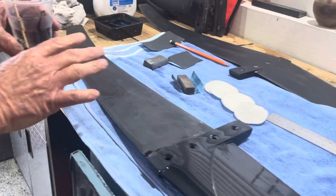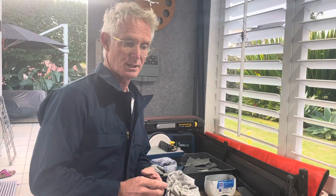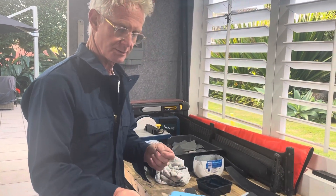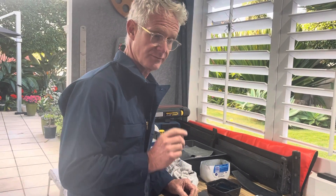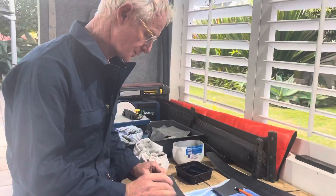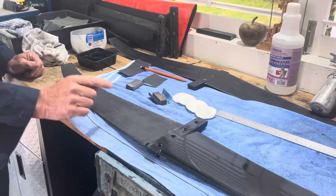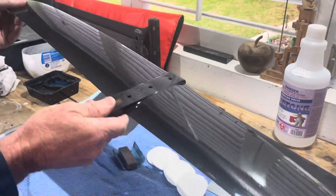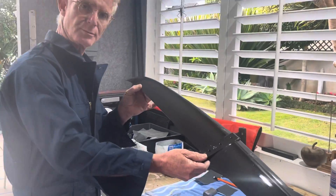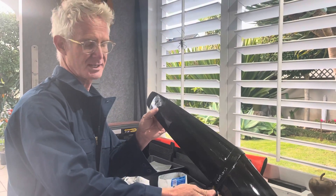Then I'll take this outside and apply Durapox again, working it up to probably a 600 grit and then an 800 grit — I may even go to a finer wet and dry; this one is a thousand grit. We'll cover that in the next video. For this video it's more about identifying the small tiny pitting holes and the final little blemishes that need to be taken care of, to make sure this is absolutely perfect — particularly the undersurface boundary layer, but also the top surface as well. There's a lot of time spent perfecting and truing up these foils, but every little bit counts, so it's worth it in the end. Thanks for watching.